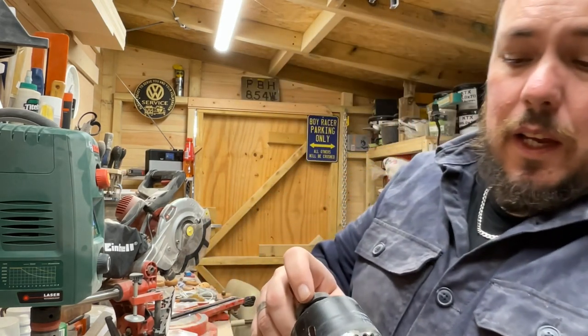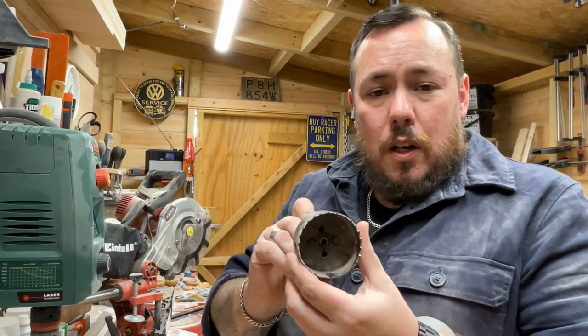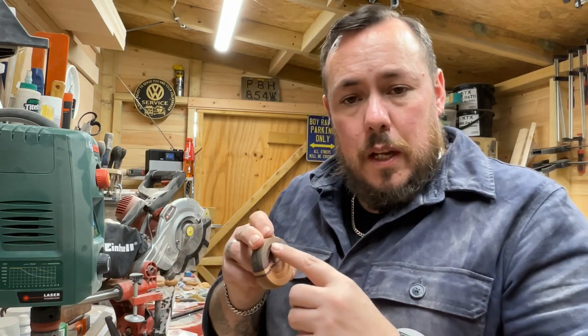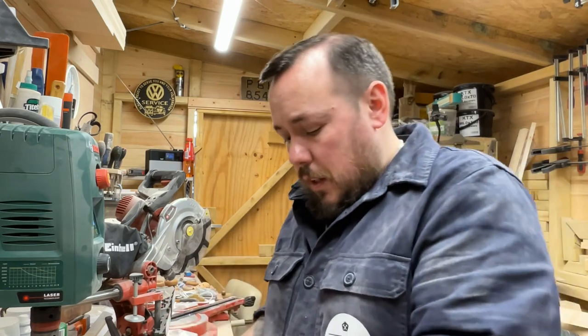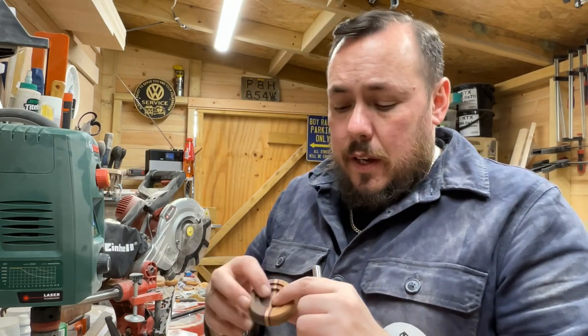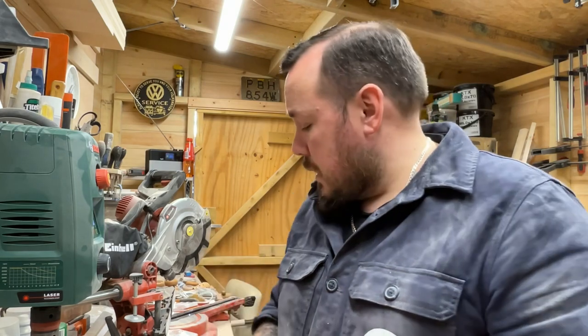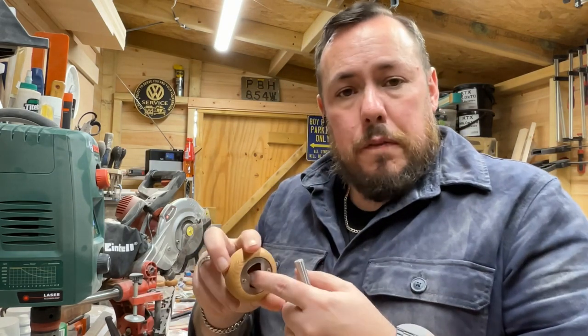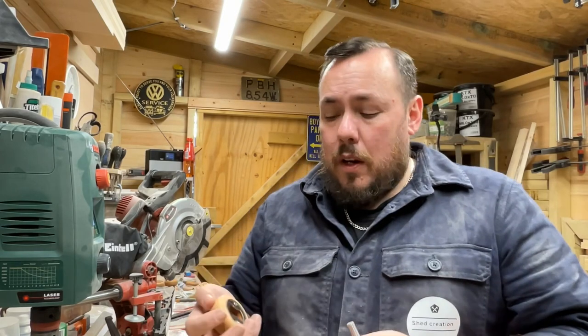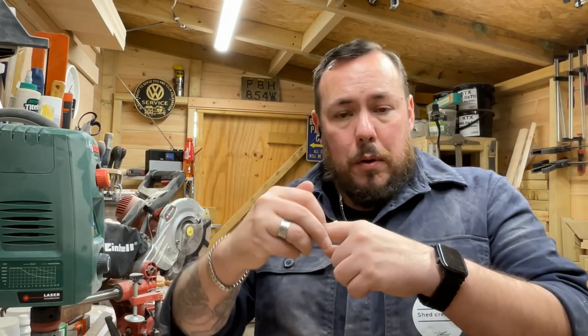What I used to make these — and it is only my way of doing it, you may find a different way — is a two-and-a-half inch hole saw. I'll put the info for all these pieces in the description. I also bought a 40mm forstner bit, which does the lip where the insert sits, and then a 28mm forstner bit which does the inside. This one I kept quite shallow — it just needs to allow the lid to get inside to pop it off, so it doesn't need to be too deep.